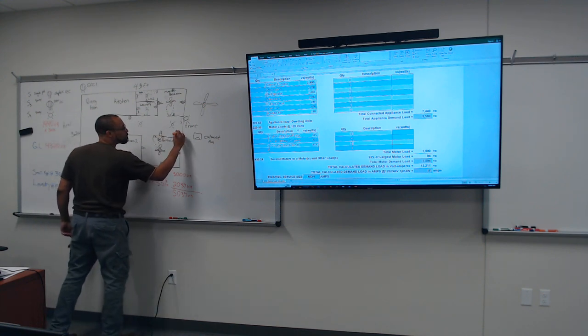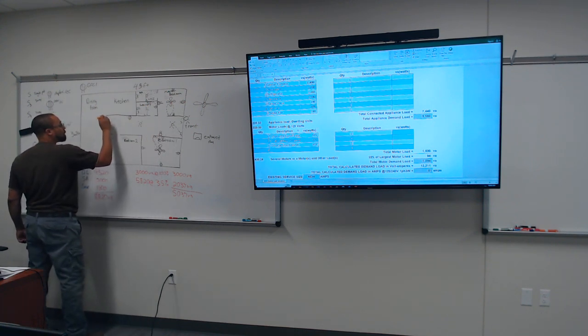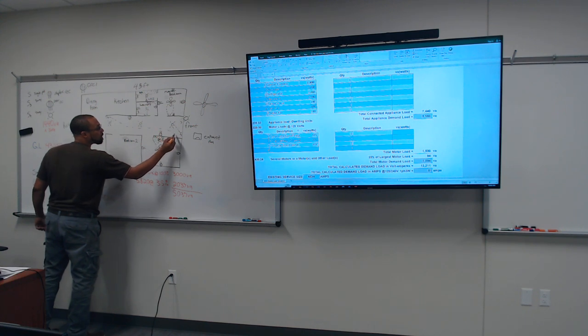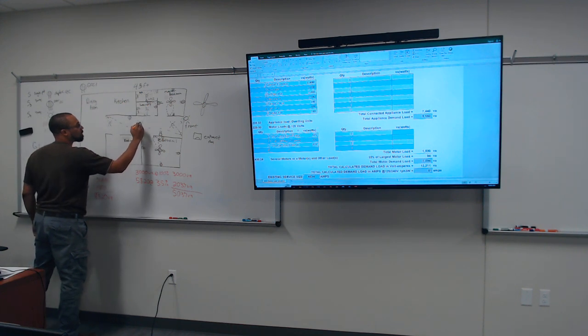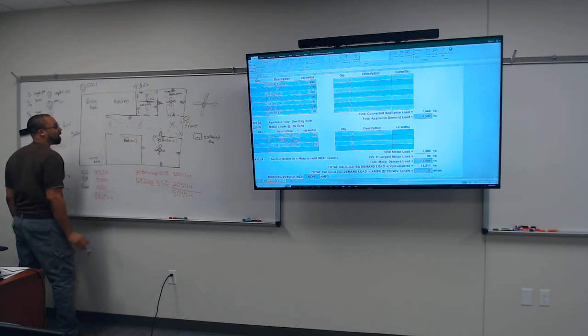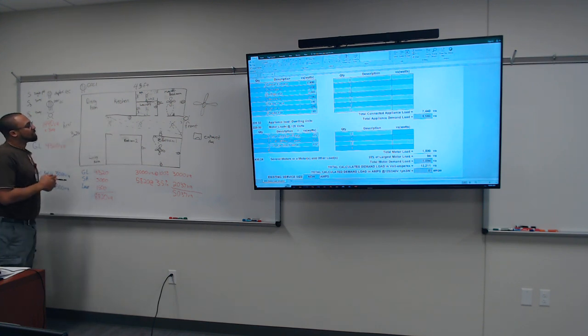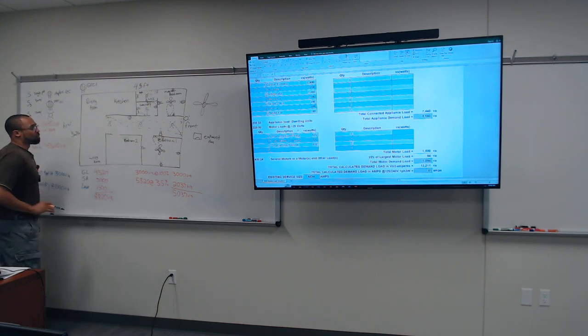Yep. So, the three-way switch, you gotta put S3, all right? Now that right there has to be connected to S3. Let's put S3 right here. These two three-way switches control these lights right here. Do you go from each switch, or do you link them together? Yep, this is it right here. It's all cluttered and everything, but we do it manually. Oh, I see. Yeah. All right, so we got three lights in the hallway, right? Got one plug. Let me tell you, that's enough. That's for the plug. I'm gonna leave that as is.